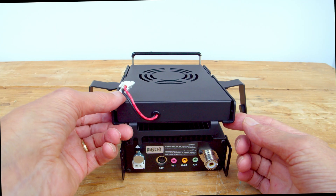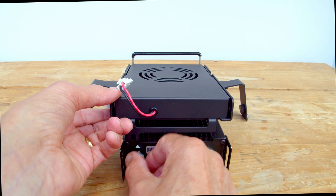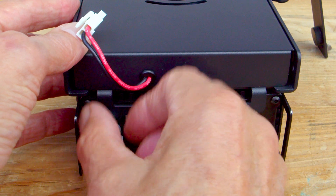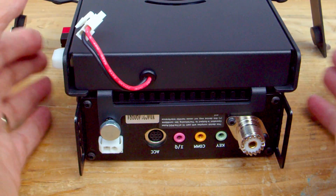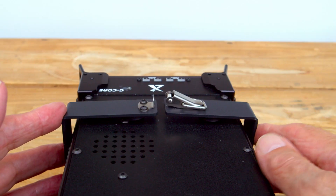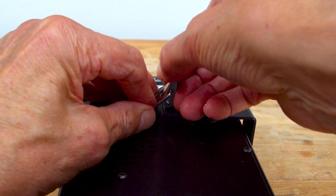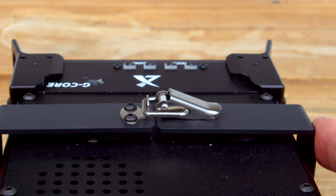Next, we place the fan unit on the base of the G90 — the G90 is upside down, with the heat sink underneath. There's an earth terminal there which we need to undo, because there's a little bracket with a cutout that fits over the earth bracket. We make sure that is in place, then tighten the earth terminal — not to hold it in place, but just to clamp it temporarily. We then turn the unit over and clamp the fan unit in place. The bracket goes from the fan over the G90 — rather like doing a suitcase up — push that catch over and there we are, the fan unit is strapped around the G90.